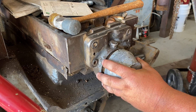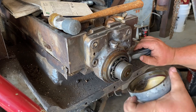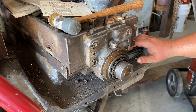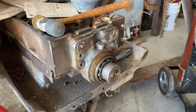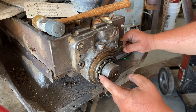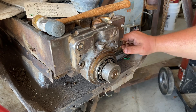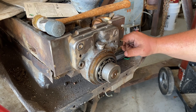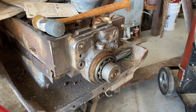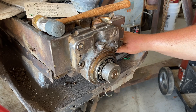Actually, wiggle this a little bit — there we go. And it has, as you can see, a tapered roller bearing in there, and this retention collar. That shaft is quite a bit bigger than those power feeds will take. Also, this machine has a backlash eliminator. So the inner workings of this might be a little more — obviously there's a little more to them than my normal milling machine.